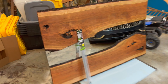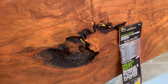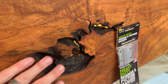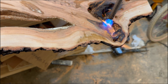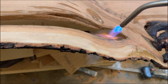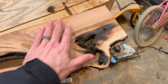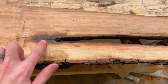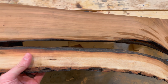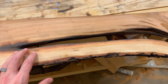Like I've done on this other one — I went ahead and torched the edge like this, then hit some of the interior pieces, and it really brings out the contrast with the wood and the dark areas that set back in there, especially areas that have kind of burled wood. Don't worry about getting a little outside the lines — when we do the final sand it'll take this back down to level, but you can see it's starting to darken up that inside edge.